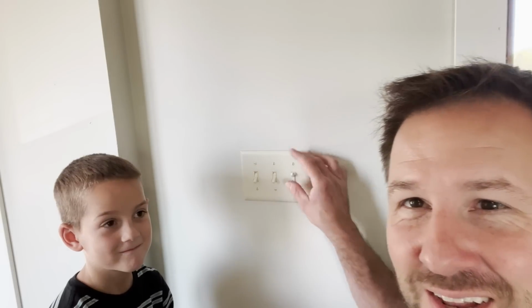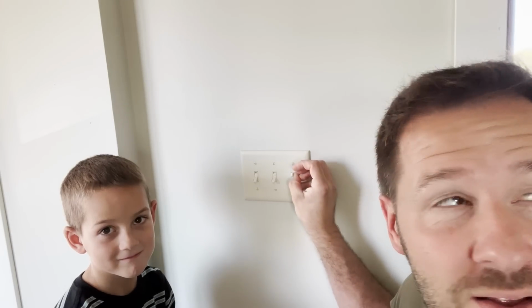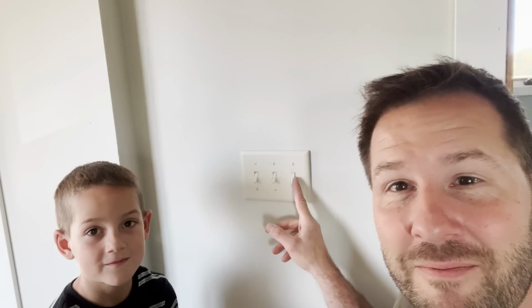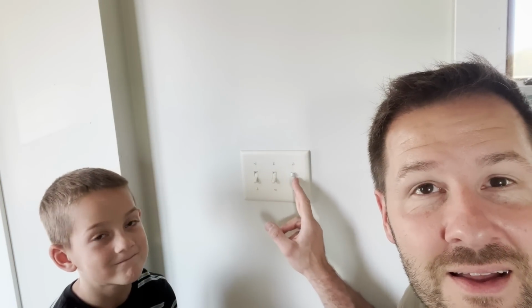We flipped the switch and the dimmer works great. But what we noticed is now the lights whine. Why would that be, Gage? You don't know, you wired this. I wonder if those light bulbs are not dimmable light bulbs. I know that the fixtures are, but maybe the light bulbs aren't. We're gonna have to look into that because Dawn is not gonna be okay with a whining light. Yeah, I'll get back to you.